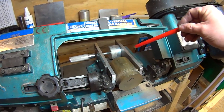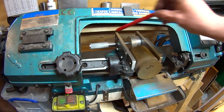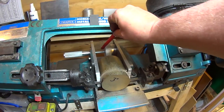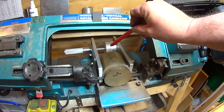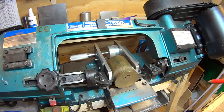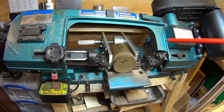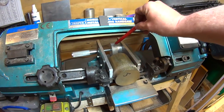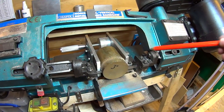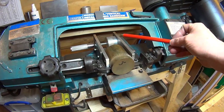There's also this clamping jack screw — a knurled handle I made out of aluminium with a piece of M10 threaded bar lock-tited into it. There's a packing piece there, just a 2-inch piece of scrap aluminium, because the bar isn't quite long enough for the 3-inch bar I'm cutting. It lets you set the gap at the back and clamp smaller pieces without them trying to clock over as the clamp's tightened up.